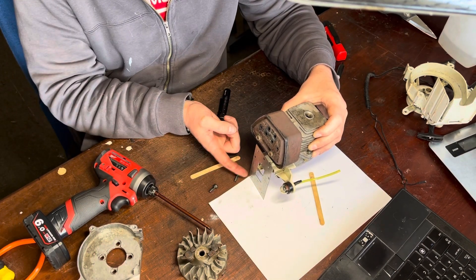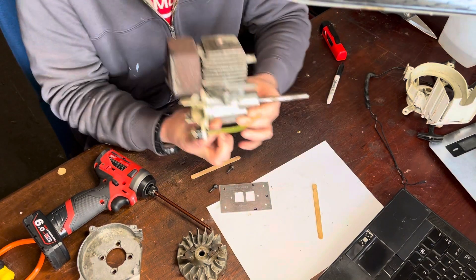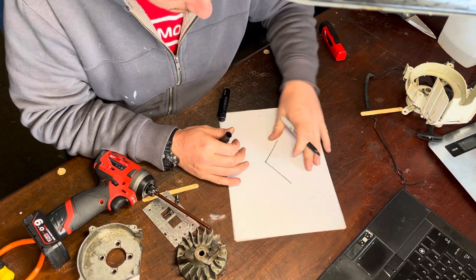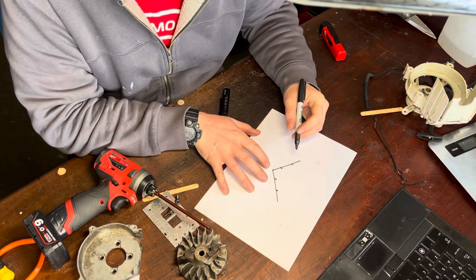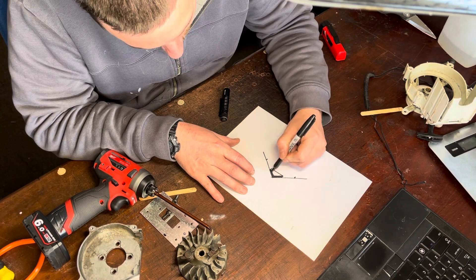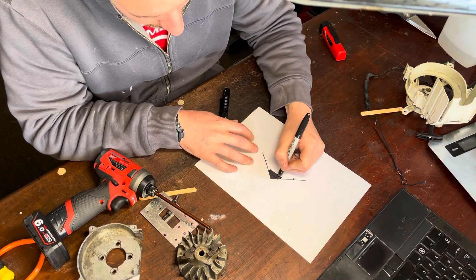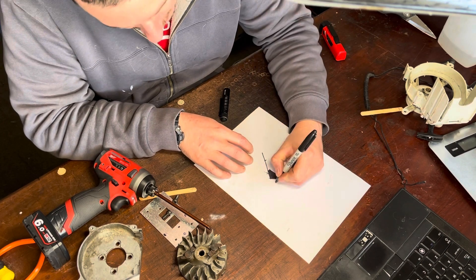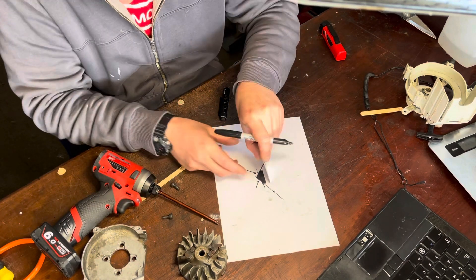And then I'll do the same thing - another connector plate here, I'll L-bend that way at a more obtuse angle because of course we're oriented this way. That will give me two means to grab hold of this engine and secure it down. So we've got the hull like this with little ribs on the inside of the boat for structure. What I'm thinking of doing is having a piece of probably pine, cut in a triangle shape. I have two options - either epoxy in this gap so I can connect the wood together and connect the mounting wood to the hull, or I can put screws going from the hull into the wood.